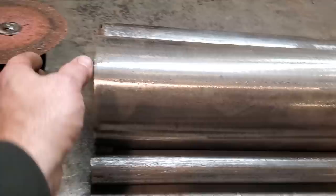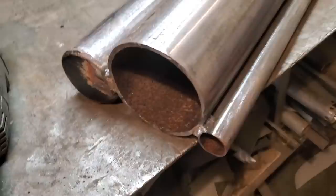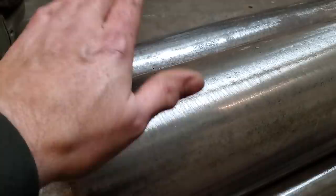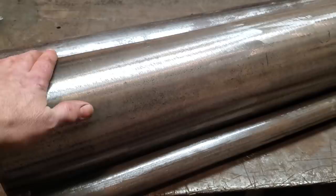I'd say because you're only doing sheet metal, you can actually build this out of exhaust pipe. This one here is like major heavy duty. That's really heavy pipe, and I don't think there's any need to have it as thick as this. This one here, you'll probably want a heavier pipe because exhaust pipe would be too thin for that one, but larger pipes. Yeah. I've seen fellas use oxygen acetylene tanks. It's a fairly big unit they use, like an old tank itself. That's empty, of course, and then they cut it down and used it for this.